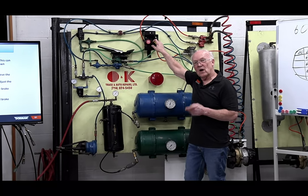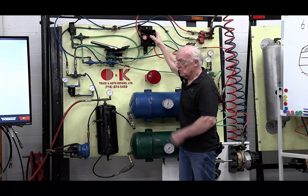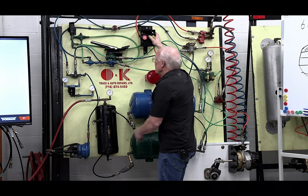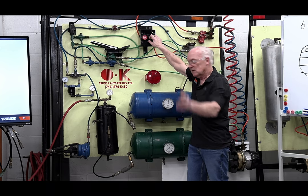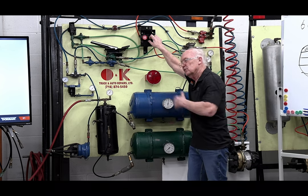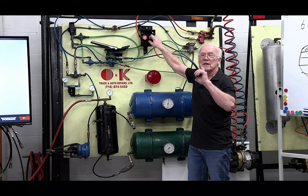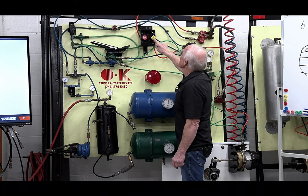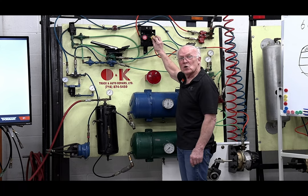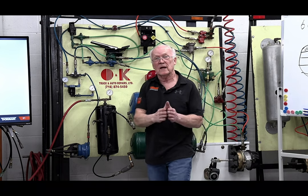Because all his life, that driver goes in a vehicle in the morning, builds up the air, pushes this in, goes down the road, steps on the brake, goes to his destination, pulls the park button, walks out, goes to lunch, and over, day after day after day, this guy takes over. Never in a million years did the guy even think about that. This here, and it's not marked, is a park emergency button. That means if something goes wrong, I pop this out and I will have those mechanical brakes.